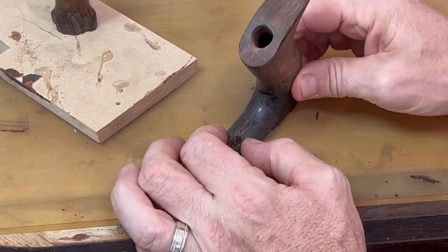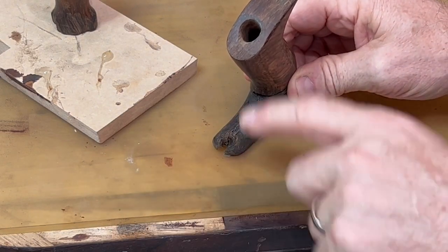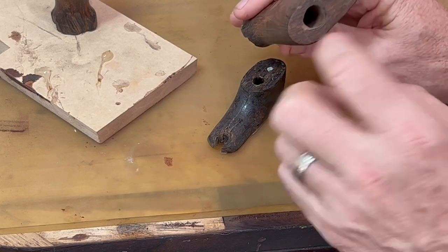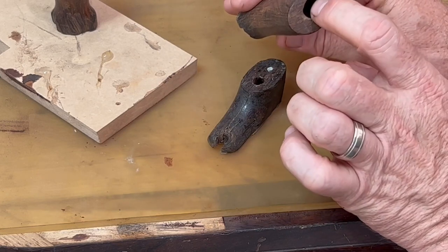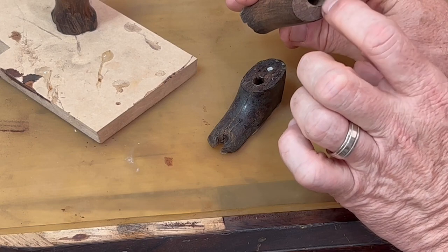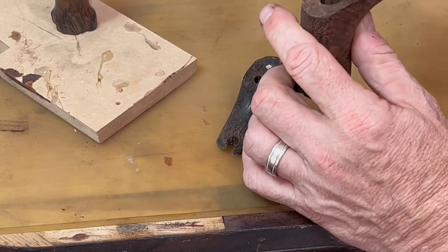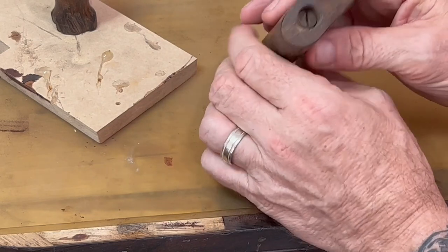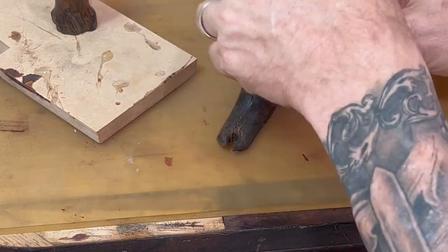Then the hard part. We've got some issues here. I'm a one-step-at-a-time person, so let's break it down. First of all, the counterbore doesn't seem to exist — it just looks like a big old crater right in the top. Someone's drilled it out way too deep. So we'll put a plug in and then re-center it to recreate the counterbore, which is so important for the barrel nut effect. We can't have that, so we've got to restore this counterbore.